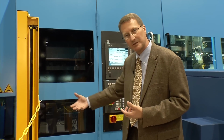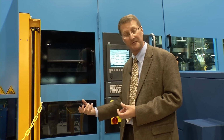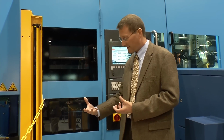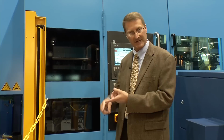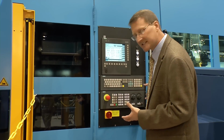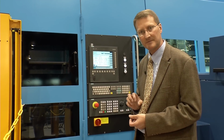As we're feeding the tube, we're constantly monitoring the pressure, which is also the force that we're clamping the tube with. We're always watching whether or not we are within the predefined parameters of the position of the clamps. If it's too big, we stop. If it's too small, we stop. The next step after the feeding process is going to be the sawing process.